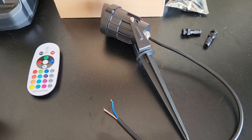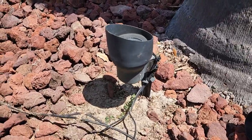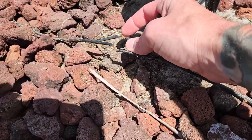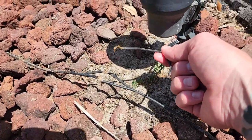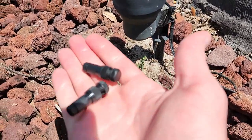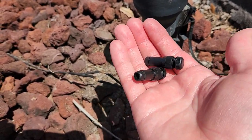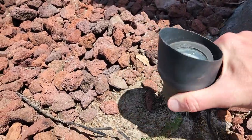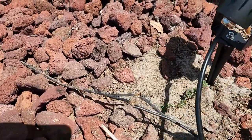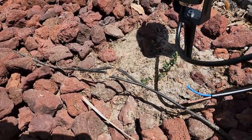Here's one of the lights I'm going to be replacing — got a couple here in front of my palm trees in the front yard. I have the wire pulled up; you can see I pulled the sheathing back on it for my previous light because the clips got so bad I just had to tap directly into the wire. These new little clamps make it a lot easier and they stay in a lot better. So we're going to get rid of this old fixture and swap it out for one of the Sun V fixtures and tap into this line right here.